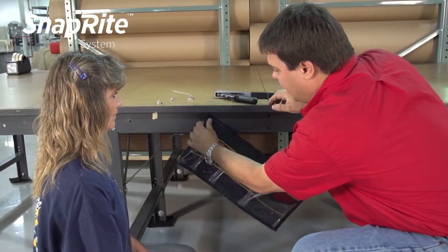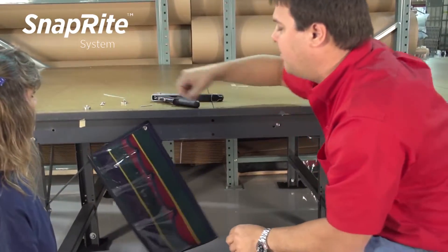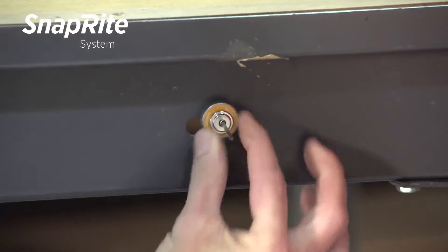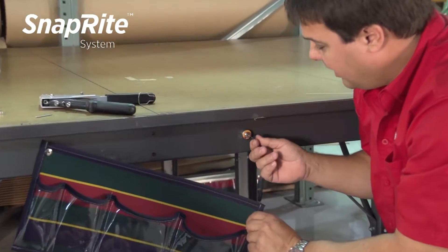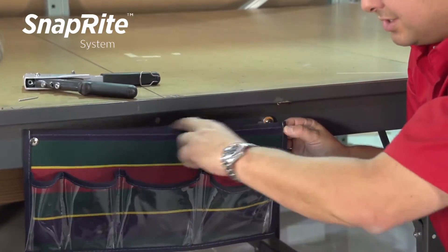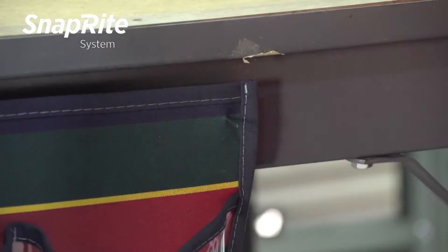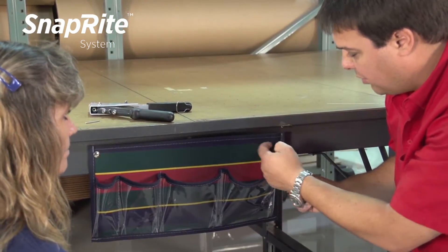Now the real key to the system is that when I take the tooling out, I can snap this to the stud that's already there. Here's where we really get into the benefit of the tool. When I take my mandrel, put it into my socket die, and snap it in position, we also need one of those sockets on there. Now I can use this as a positioner — I can pull this material over with some tension. What I want to do is bend the mandrel a little bit toward you so that the hole is slightly tight through the center and this doesn't have any slack in it. I'm going to try and get this at about the same level as the first one. That looks pretty good. If I wasn't happy with how tight it is, I'd pull this off, punch a new hole with the mandrel, and move the hole right or left, whichever way.